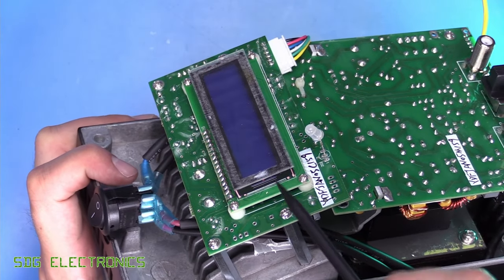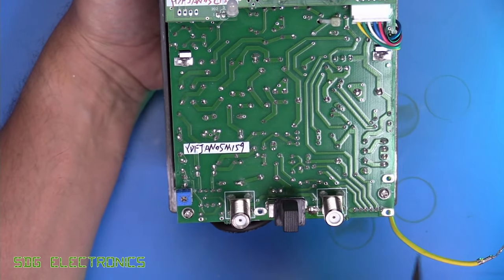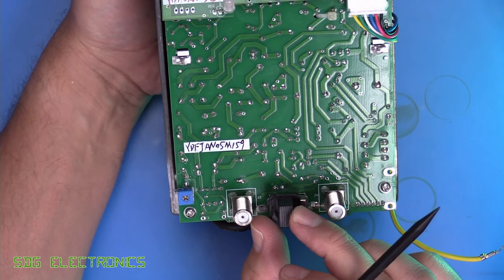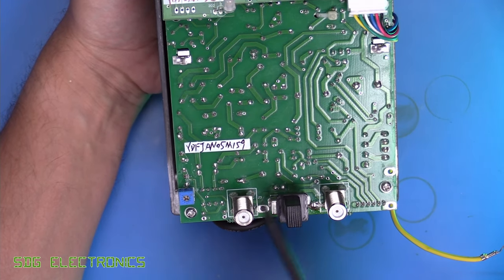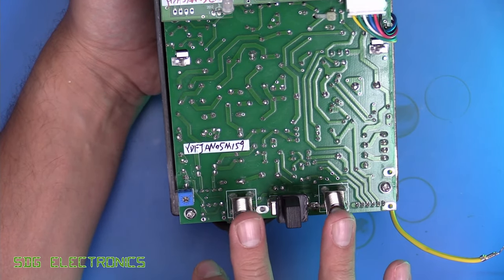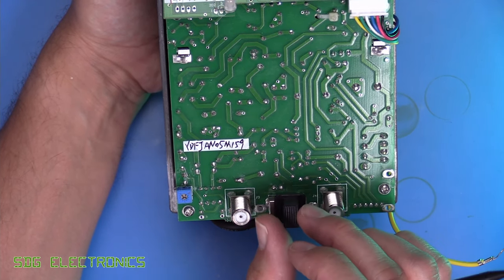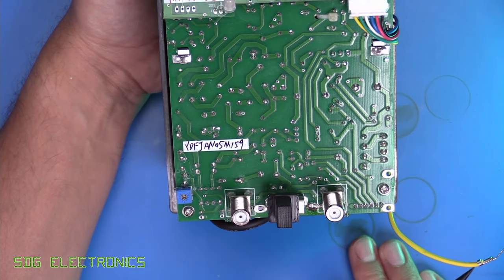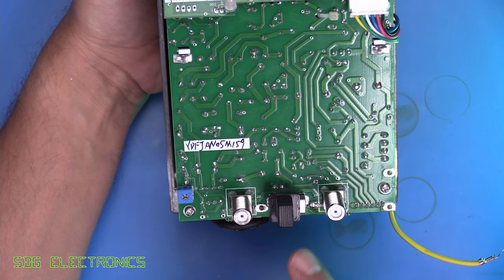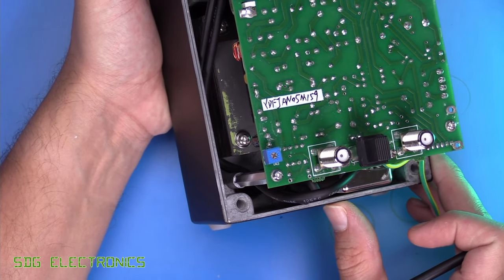The top board is really just for displaying the amount of power being delivered to the handpiece. On closer inspection, the slide switch at the bottom switches the power output directly — so this flimsy slide switch is actually handling 40 watts out to the handpiece, which is pretty poor. I'd much rather there was some digital switching; given how cheap this switch feels, I wouldn't want to be switching it too many times before worrying about the contacts wearing out.